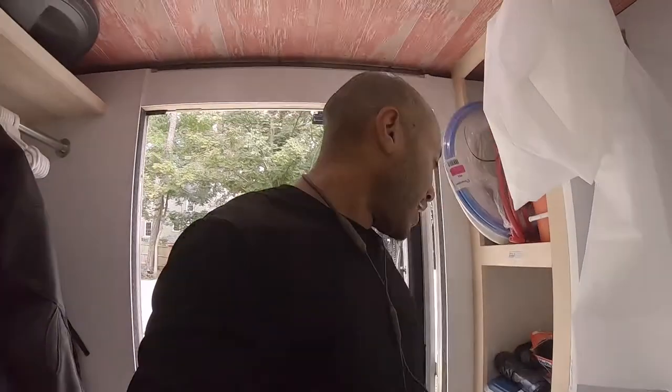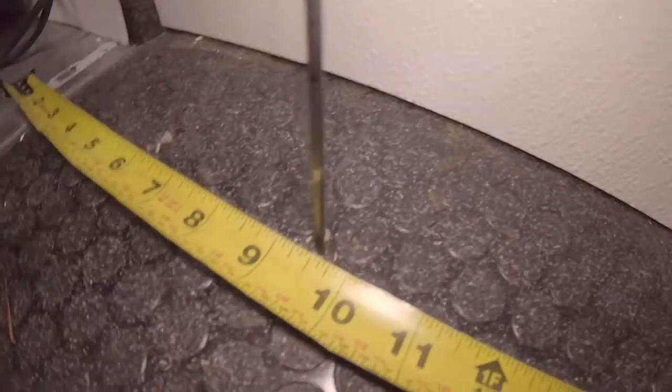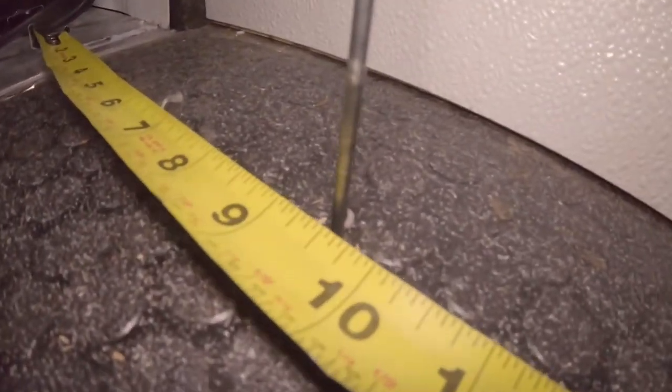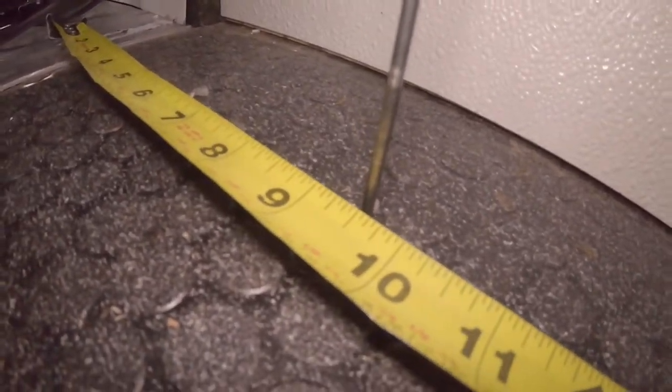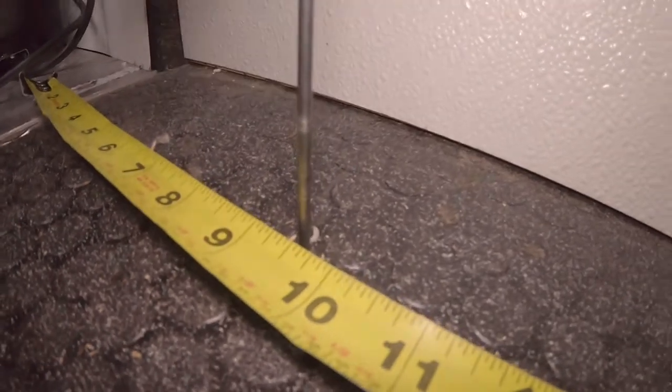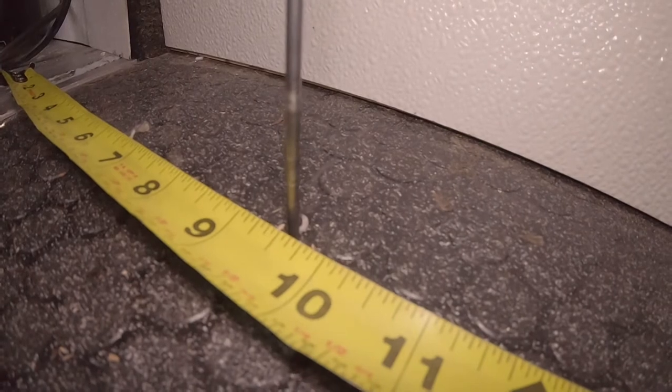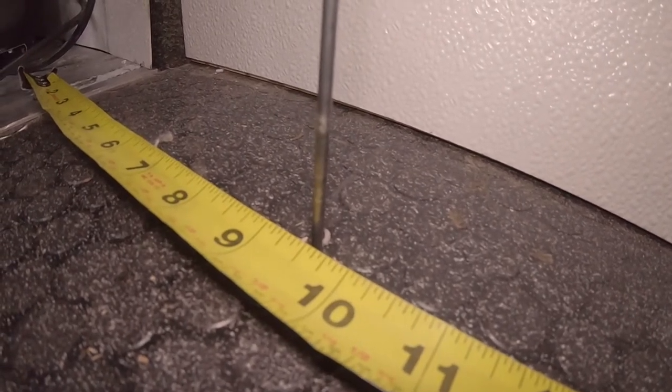That's the important part for this, because everything's based off of length and how I'm running it, based off of where the fittings for the sediment traps will live. So let me find those holes, and then we'll get to assembling our drip legs and stuff. All right, so I sent a pilot hole through, and I left the drill bit in there so we could go on the bottom and see if that's where we need it to be. And the hole is small enough that if it was a wrong spot, we could just put some silicone in there and block that back off. But it should be good where it's at.